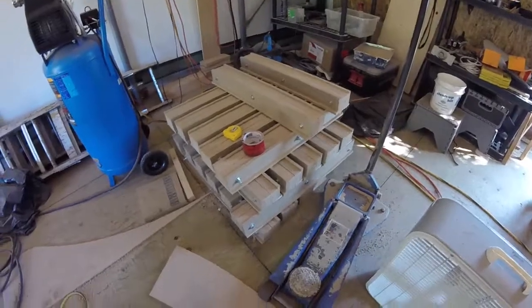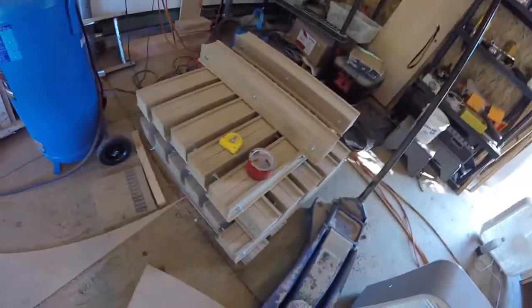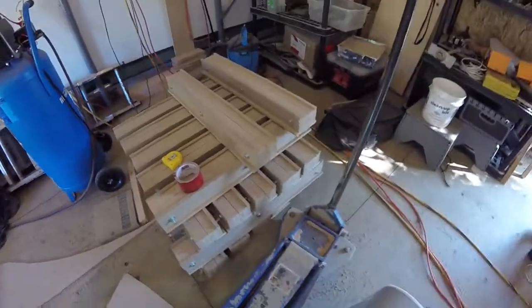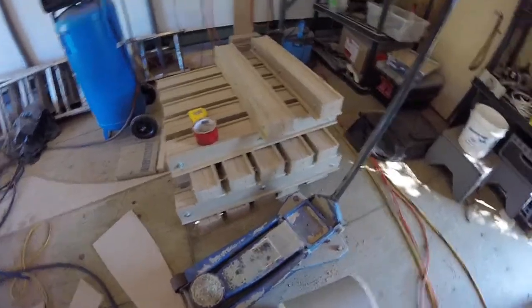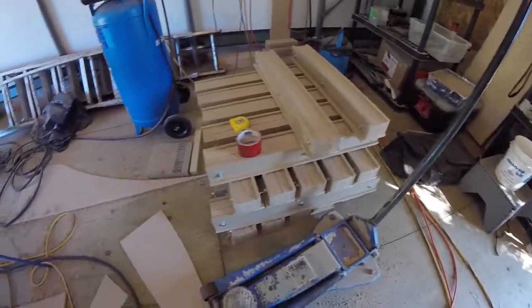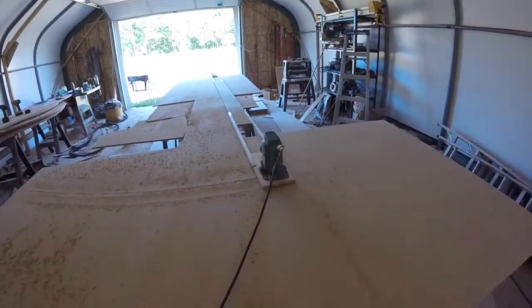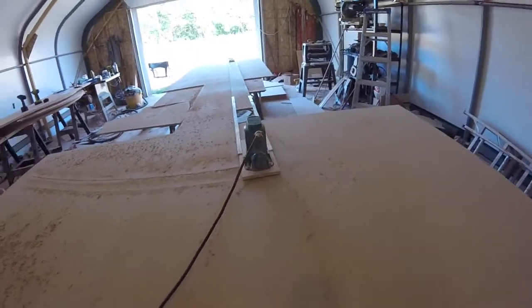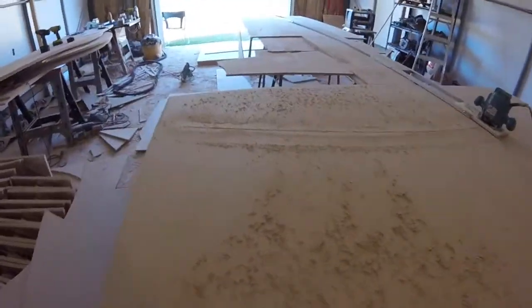Here's the pile of joint blocks already made, double tongue and groove. These are all MDF joint blocks this time, a little better suited for a commercial track as far as I'm concerned. Anyway, now I can take this monstrosity of a cutter head apart. I only have one more corner left to cut, and it's a more normal size.